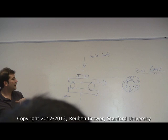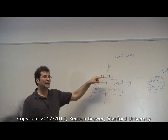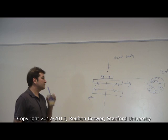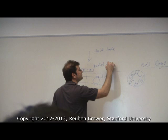And then sometimes if you're getting tricky, they'll put a third bearing in, but we're not talking about that. I just want you to see, if you were to get a cheap thrust bearing, you have to use a normal bearing to align it radially and take radial loads, and that would be fine. I think it's just one. I don't know. I've never actually built it this way, but every time I ask someone about it, this is how they tell me to do it. The point is, this is for radial alignment and loads.